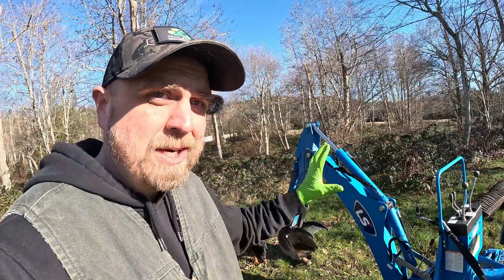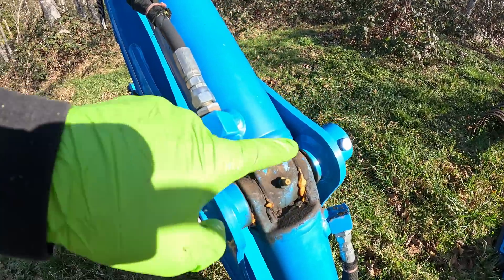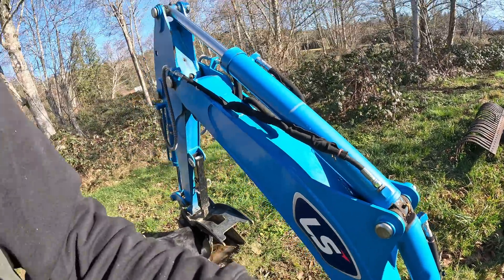How about your backhoe? You're going to grease those components every 10 hours of use. These are pins connecting the joints together, and if we want to prevent them from seizing up, we've got to grease them — every 10 hours, if not more. The extreme pressures from using a backhoe will squeeze grease out everywhere. Eventually you lose that grease, and extreme pressure actually breaks down the molecules grease is made of, turning it into sticky goo or glue that does nothing. We want grease to stay greasy.